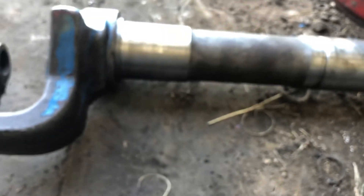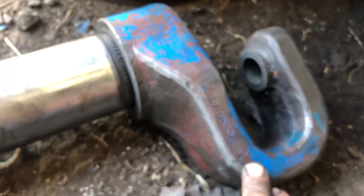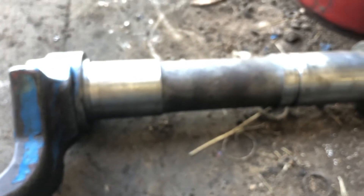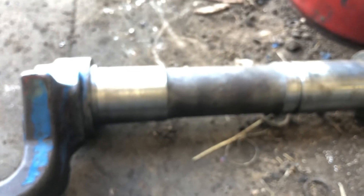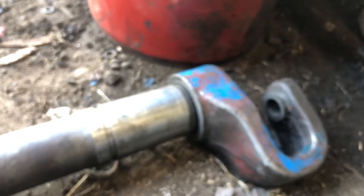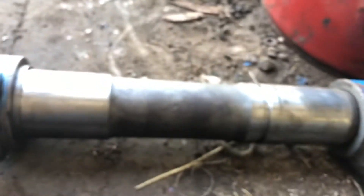You can do it without removal - I would say you could probably do it if this comes off easy. We literally could not get this off without cutting it, but if you can get it off you could literally have new o-rings in in probably a half hour. According to one mechanic, that's a good fix. But this one with 12,000 hours and a lot of plowing had a severe amount of slop - this thing would rock. You can actually see right here it was actually rolling the metal over because it was rocking up against the transmission so much.